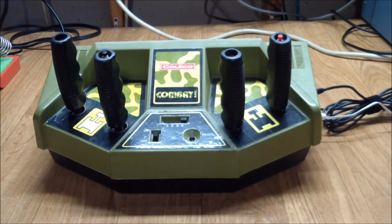The only way to prove that is, of course, to either spend eons checking the video signal and monitoring signals on the bus, or the other thing is getting a replacement GI chip, and since it's socketed, simply replacing it and seeing if the symptoms persist. If they persist, then obviously it's not the chip, and if they go away, then you got a bad chip. But I think the purpose of this was to demonstrate how to go about taking something really old like this, and how to go ahead and do the more basic troubleshooting on it.